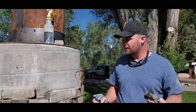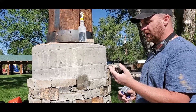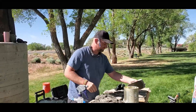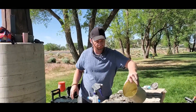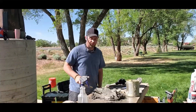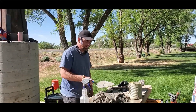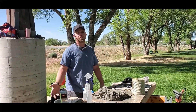This is so dry and hot that we've got to keep spraying things down, or else it will just suck the moisture right out of the mud and the rock will pop off. But if we keep it wet, it will stick pretty well. This is a particular type of stone called Telluride stone, quarried in Telluride, Colorado. It's kind of a bragging right to get Telluride stone. Every stone quarry is unique — Telluride stone is just another unique stone; whatever quarry any other stone comes out of is also unique to that quarry.